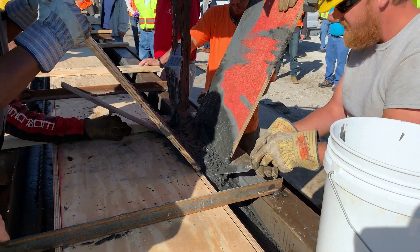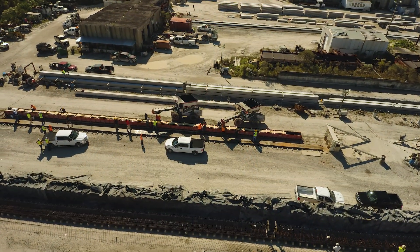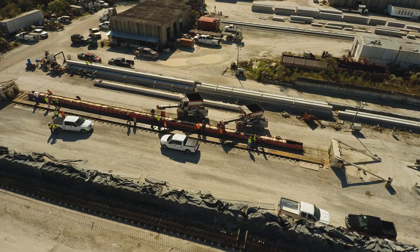For the creation of this full scale sample, we once again use the same top-down gravity fed production methodology as we have in the creation of the two 60 foot H piling test samples featured previously. Just like those prior test samples, this full-length example was free of any cold joints, voids, bug holes, or scaling of any kind.